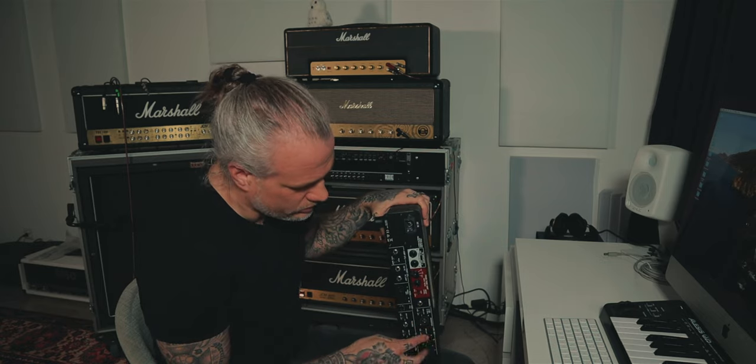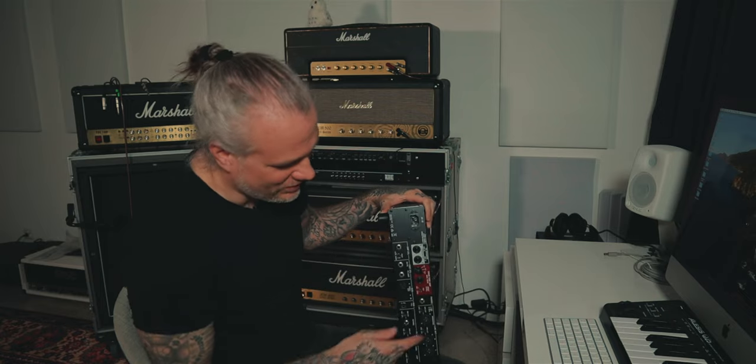And how this differs from these two? Well, no matter what you do here on the level, it doesn't affect the front of house. I guess they thought of it because, you may know, you play a show, in the beginning of the show your amp is on a certain level, and then when the show ends, you suddenly realize that you have turned it louder and louder. And usually, front of house engineers don't like that. At least they've said to me many times, hey man, the levels were really good, I was able to get a really nice, balanced mix, but then you turned the volume up during the show, and at the end of the show the guitar was basically coming from the stage and not from the PA. And then the front of house can't really do anything, because he can't make it quieter if it's real loud. So I guess they thought that no matter what the player is doing, whether he's increasing the volume or not, the front of house will get the same consistent signal level.